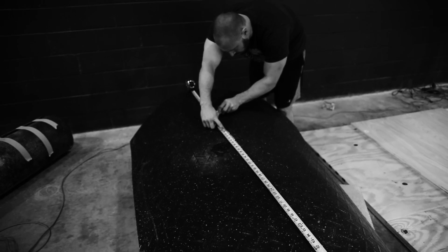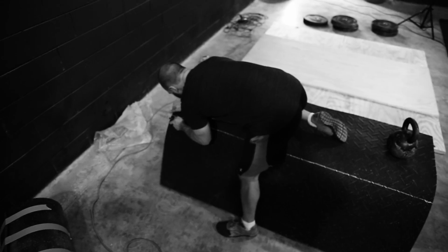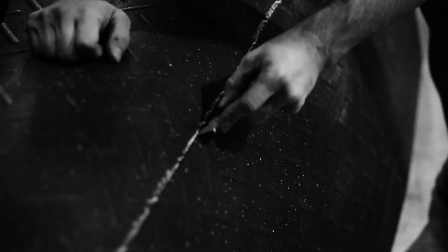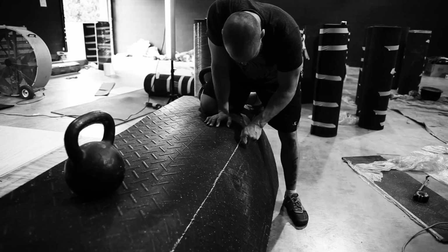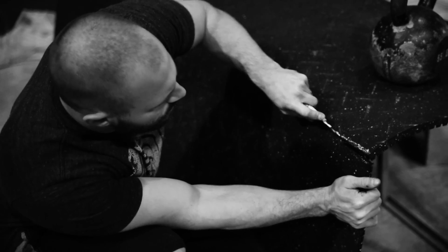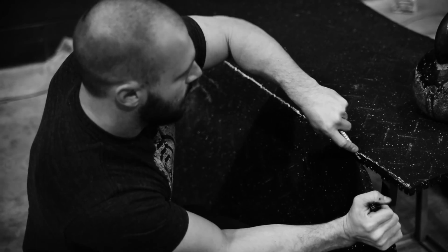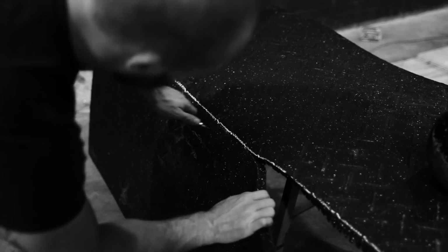Now this will be a 4x6 stall mat, and the platform is going to be 8x8, so obviously we're going to need to cut 2 different sections. You can use any knife to cut these, but it can be kind of difficult. The best thing to do is probably to use a box cutter. You'll want to put it up on some type of elevated surface so we can bend it in the middle. You'll score it once and then come back through and finish the job.